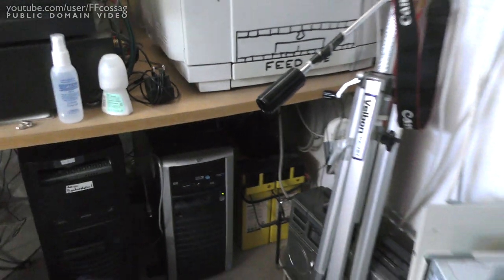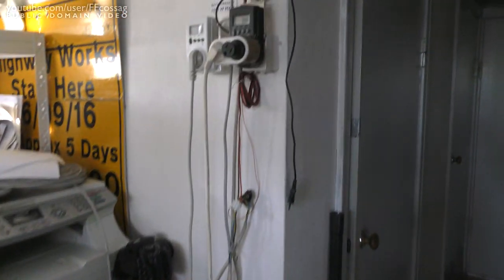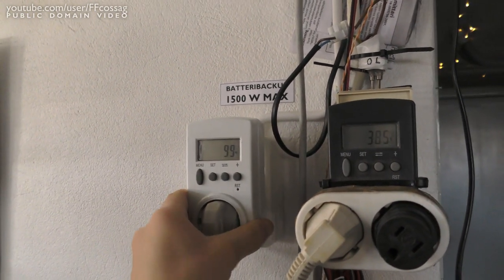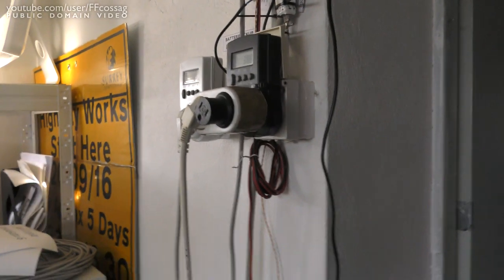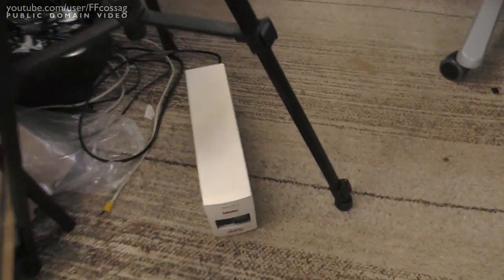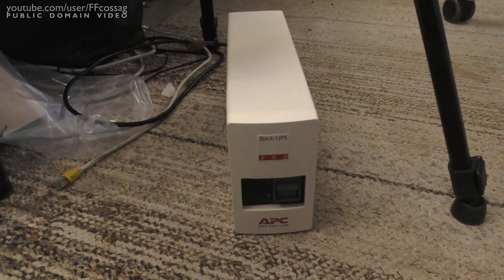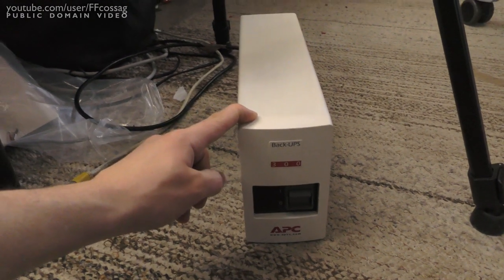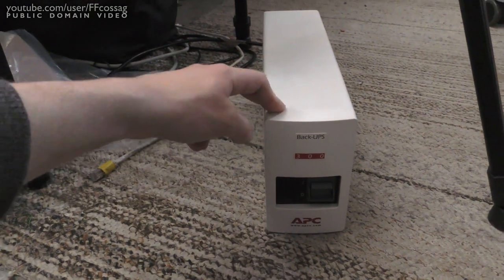As a solution to that, I'm just going to scrap that UPS system entirely, because the power outlet I'm using for the server is already battery backed — it's coupled to my solar system, which has an absolutely giant 48-volt battery backup system. I figured we'd just take some time to put this little basic UPS, a BackUPS 300, in place to back up only the server. We'll see how much that 100 watts drops going from a 1500VA line-interactive UPS to a 300VA offline basic UPS.